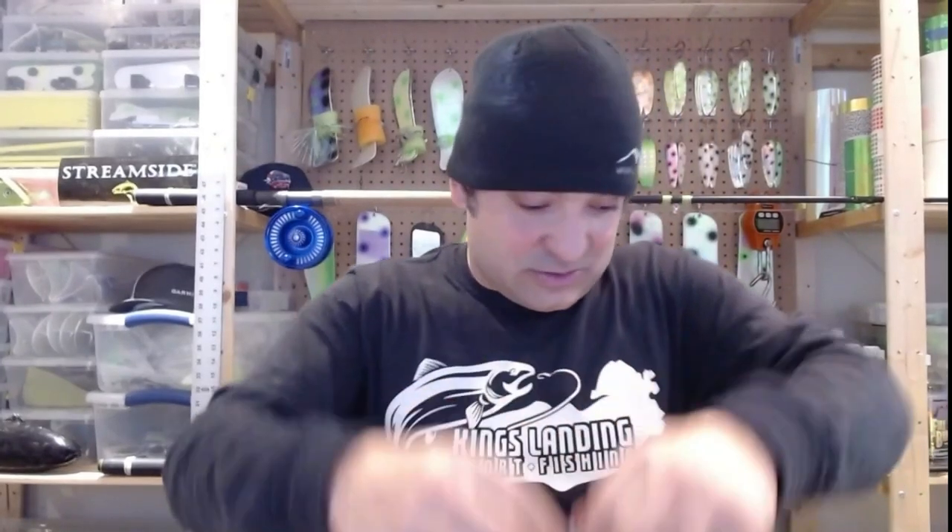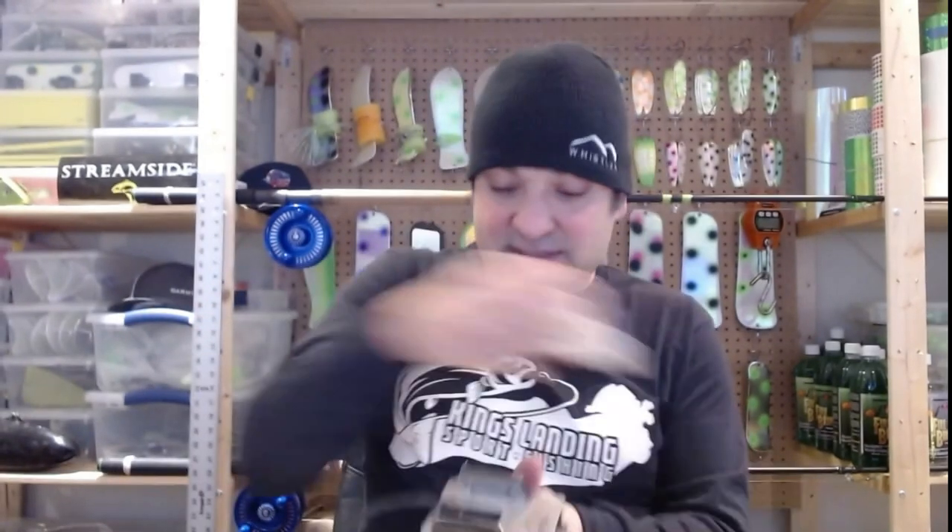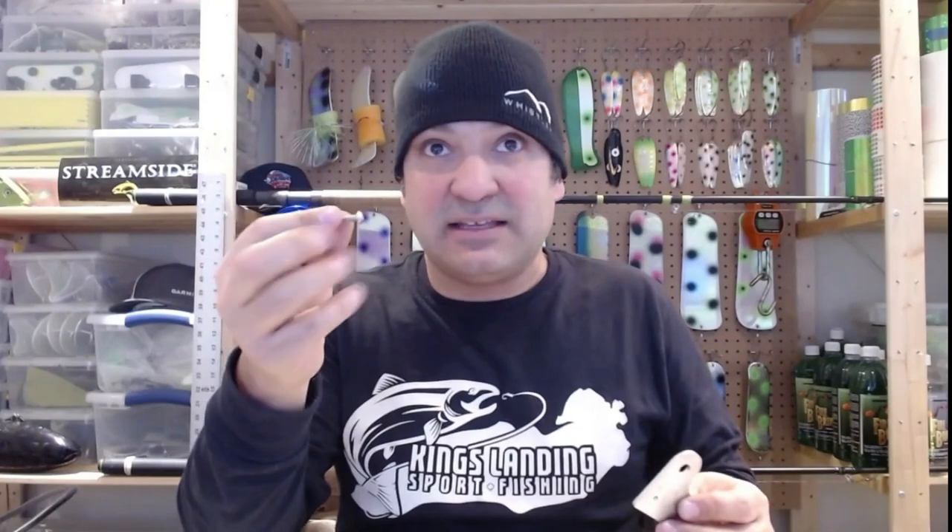I think I've got almost all the tools I need — my screwdrivers, my wrenches — so I can show you how quick it is. So, Fishhawk transducer — this one's a used one off one of my boats. I'm actually going to put it on the back of the Tiara this year. So, Ritek mounts: first piece just slides right into the existing Fishhawk transducer like so — fits on the top, puts a stainless steel piece on there. Now you can see there are holes to actually mount this together. The next piece: I'm going to take these little brackets and they go on each side. Ritek provides stainless steel bolts with lock washers, so I'm going to start assembling these together.